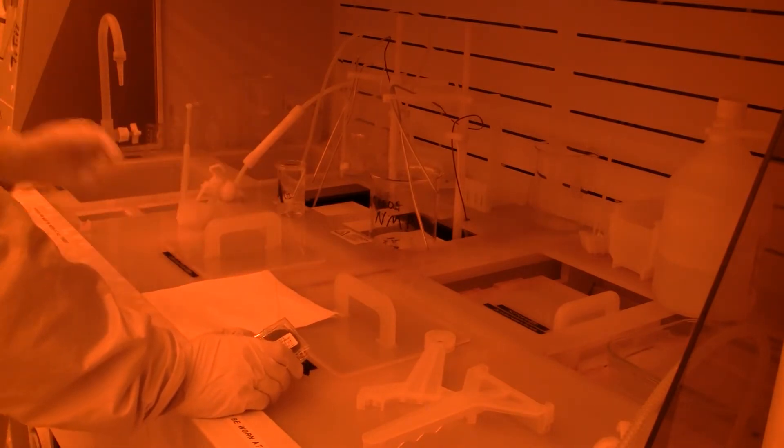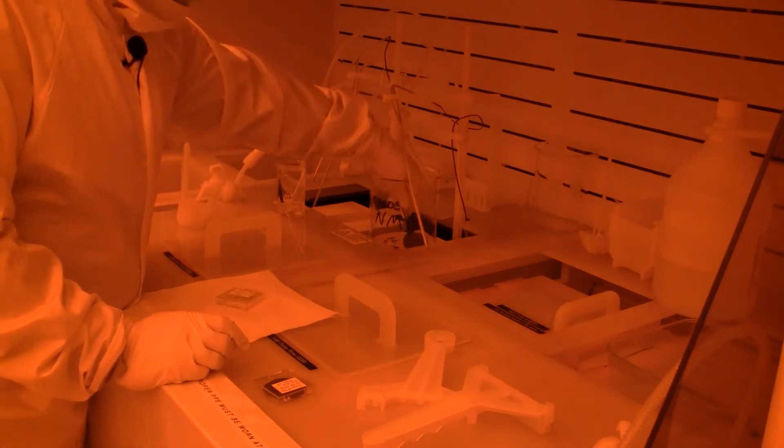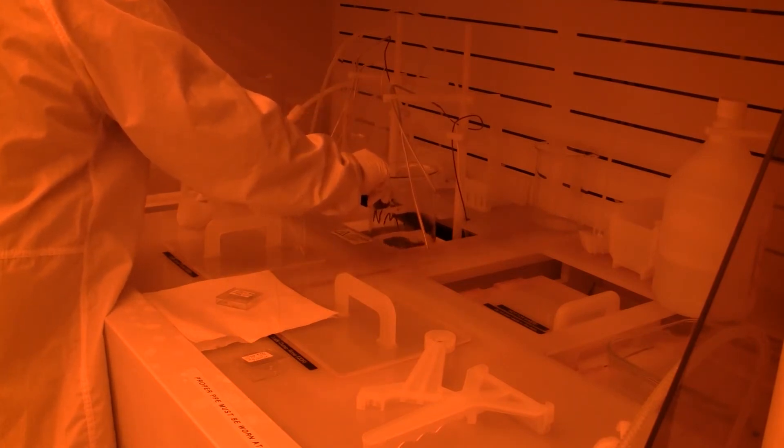As usual with these fancy hot plates, the first thing I do is defeat the level indicator interlock with a little bit of DI water so I can overcome the level interlock. The NMP — the hot plate is sitting at 90 degrees C, so the NMP is probably around 70. All you have to do is pop these wafers in there. NMP gets along with all of our materials; we know it's CMOS grade, a very high purity reagent. We just pop the wafers in, give them a swirly swirl, and let them sit — about five or ten minutes at a nice cozy 70 degrees C.